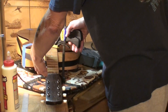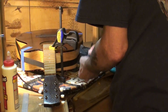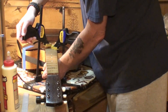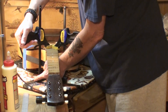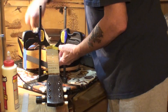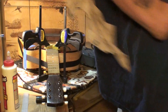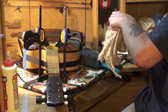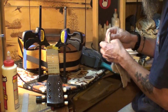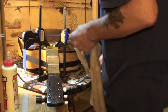You want one clamp right here — yeah that looks good — and one just opposite of that, except down a little bit lower. You've got some serious squeeze-out going on right here. A little short screw and a long screwdriver with a tiny head really comes in handy for getting into those tight places to wipe squeeze-out away — and in good time, I might add.